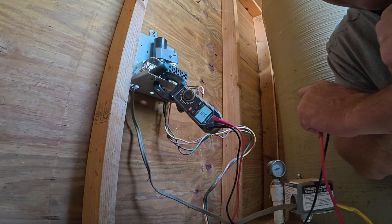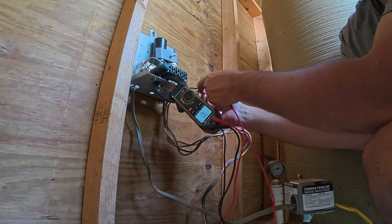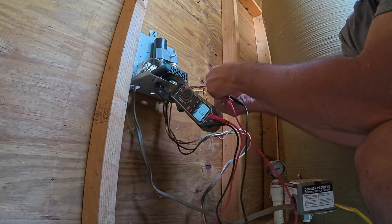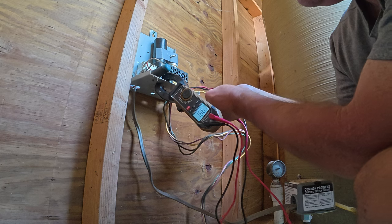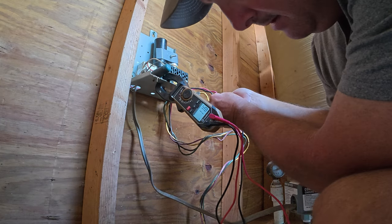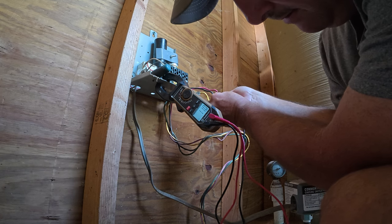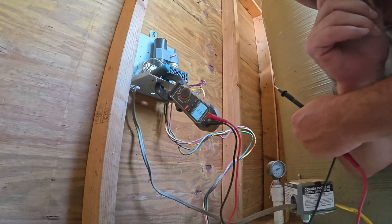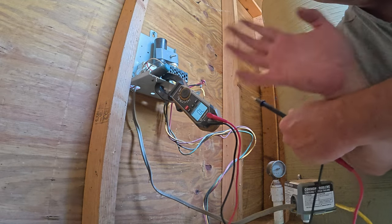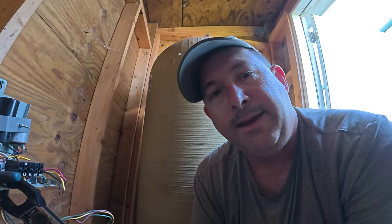Next, red and black. I'm right at 11 on that. My tolerances within that are 9.7 to 11.9. So that tells me that the motor is fine — all of the windings are fine. They read within the spec of what this controller wants.